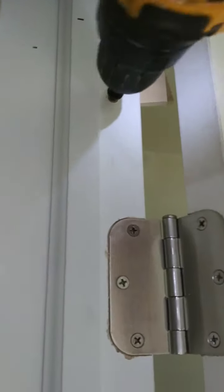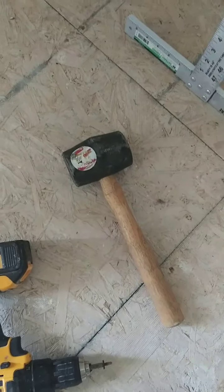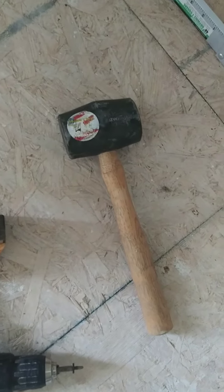I went around and got my shims in everywhere around all four corners. That's how I like my reveal — reveal all the way around. We're going to close the door and make sure it's not rubbing — nice and smooth operation. The last step is to walk it down with some pocket screws. You can use any screw — this one's for cabinets and kitchen cabinetry. You want to countersink that head in there because the doors get painted, so we'll fill those with wood putty. Two doors down, a few more to go.